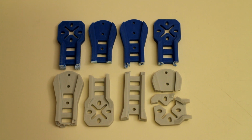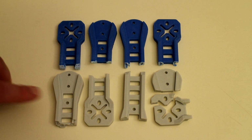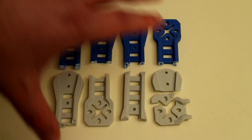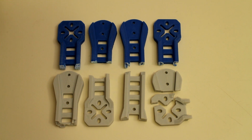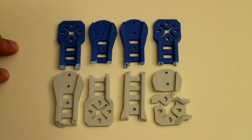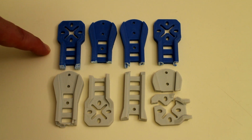When choosing a material to print your quadcopter frame in, whether that be ABS, PLA, PETG, nylon, or polycarbonate, it pays to print the quadcopter frame, or at least the pieces that are most likely to break, as solid pieces rather than having a lower percentaged infill. This test has really opened my eyes to how much extra strength can be had from the material that we're printing with just by printing solid. Okay, at the expense of extra weight, which is a detriment to a quad frame, but if that means that we don't need to replace the arms upon every single crash, it might be only every 5th crash, I think that's worth it in the long run.